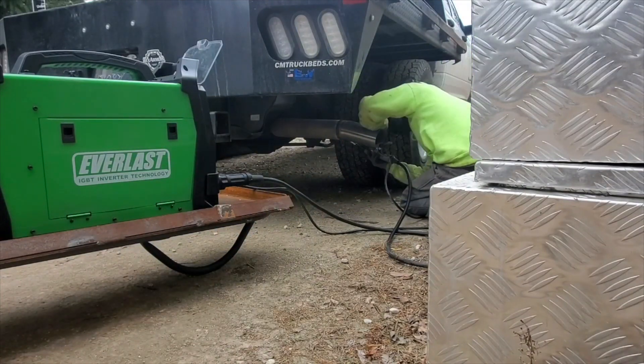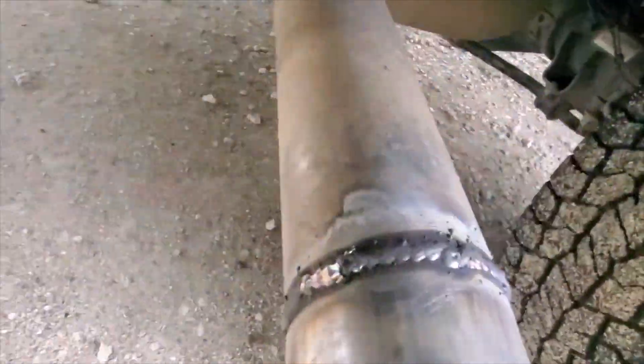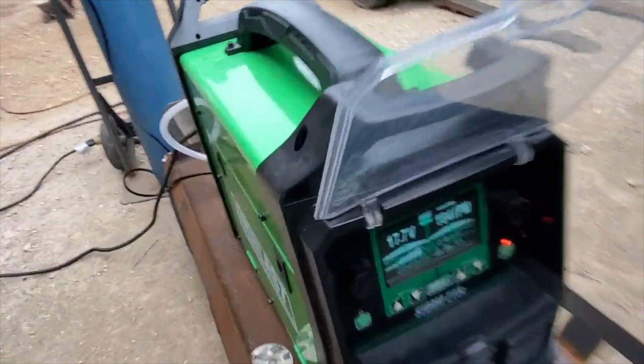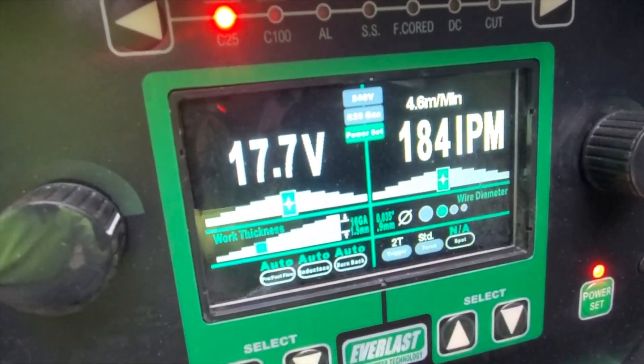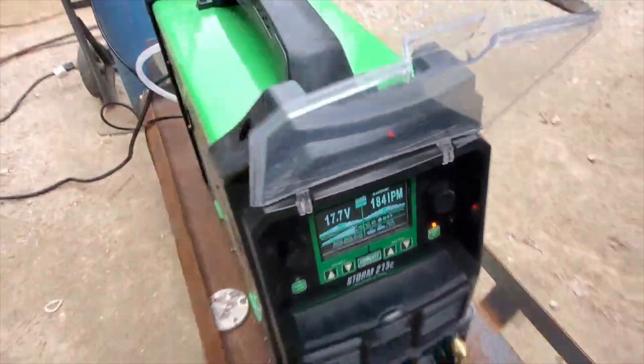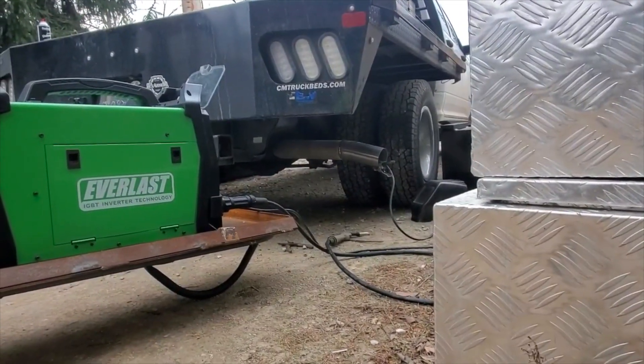So here we're doing the exhaust and then after that we're getting the toolboxes ready. We're using the plasma on it. And let me tell you — I did a comparison video with the Everlast machine before and like a Lincoln 210 MP, and I felt like the MIG arc on the Everlast machine was a little bit rough. On this machine, Everlast really upped their game. This machine welds so much nicer than any previous generation MIG machine that they had. When you look at the screen layout here, it kind of reminds you a little bit of like a 210 MP. What I've found is that the voltage on the left there, displayed while the machine is idling, there is a discrepancy of a couple of volts compared to when the machine is welding. But you dial it in the way it needs to be dialed in and that thing is singing like a sewing machine.